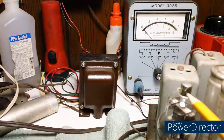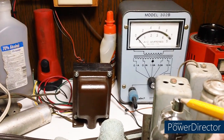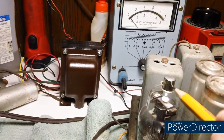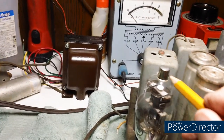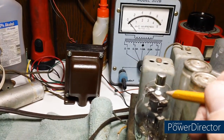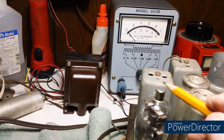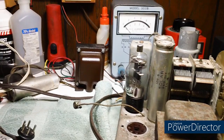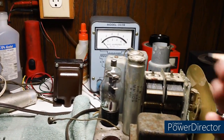If you pull the cap off, it's fixable. Underneath the cap is a tip of glass with a wire coming up through it, soldered to a hole in the top of the grid cap. If you break it off, extract the solder from the top of the grid cap, clean it out, then chip away the glass just a little around that wire. You can attach another thin wire, solder it up. As long as no vacuum has escaped from the tube, put the cap back down over that wire, run the wire through the hole, solder it, clip it off — you're good to go. I learned that from the Antique Radio Forum.